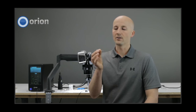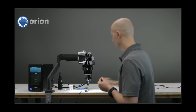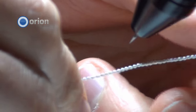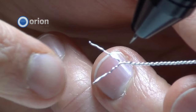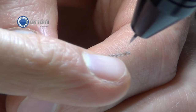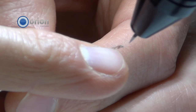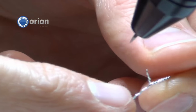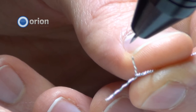If you need the wire to be thicker, what you can do is take two strands of 28 gauge wire and twist them together. That'll give you a thicker piece of wire on one end if you need to add more metal. This I'd recommend more for filling porosity or a hole. For retipping a prong, use the single end of the wire.